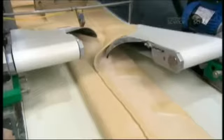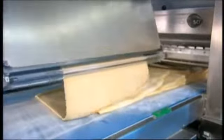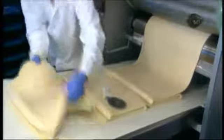Then rollers compress the overlapped dough ends to seal the margarine inside and flatten the whole thing down to about a centimeter thick. The next station repeatedly folds the dough over itself, then, with rollers again, presses the layers into a thin sheet. This laminating cycle repeats over and over again until each dough block coming off the line comprises 243 layers.